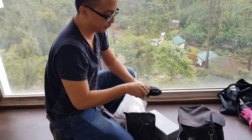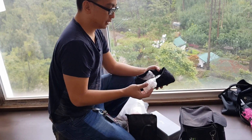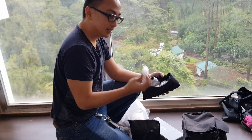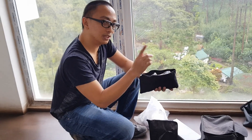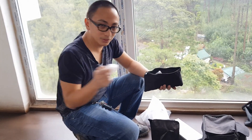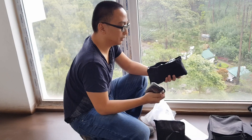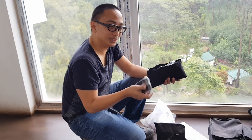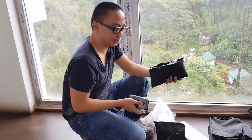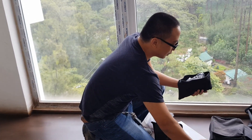My bag is a bit heavy because of the construction side. This one is for the cable tracer — it has its own LED. So when we trace cables on our 110 patch panel or on our patch panel at the electrical room, one unit stays at the connection point and the other one goes to the electrical room side. When you plug it in, the 110 patch panel lights up at our cable connection. It's a much easier way than doing it manually with a tone tracer.